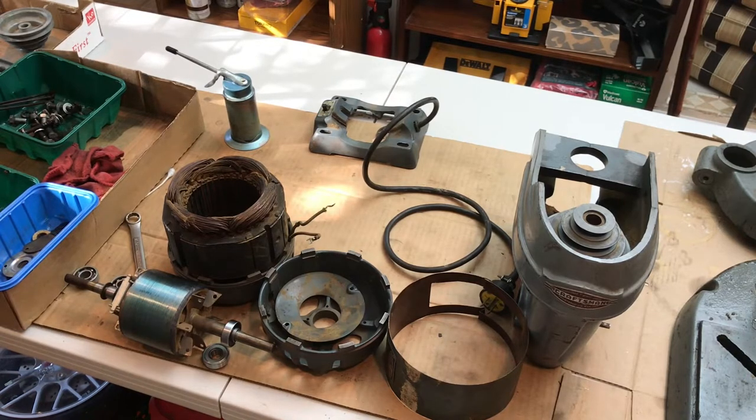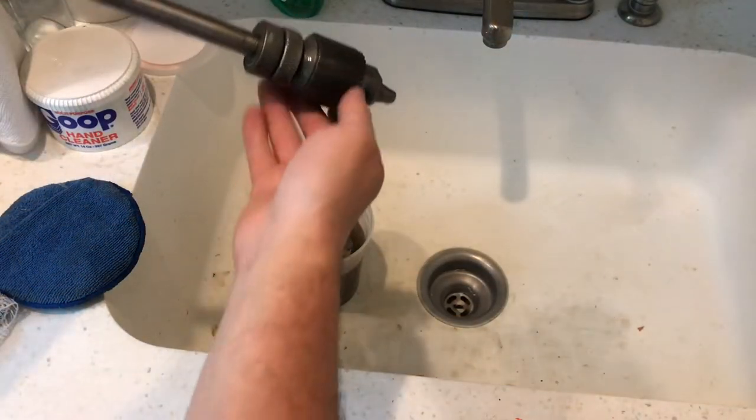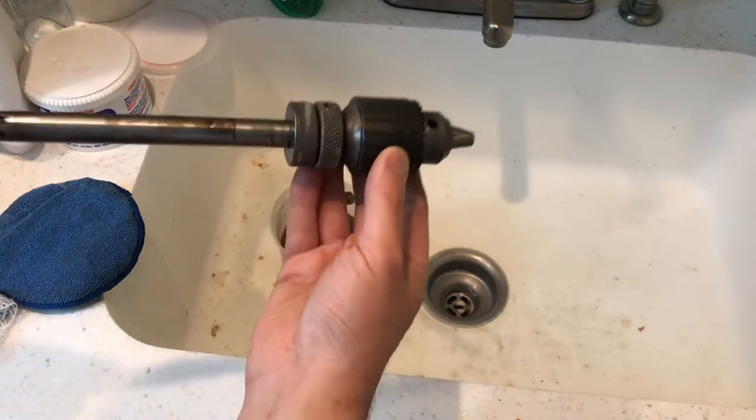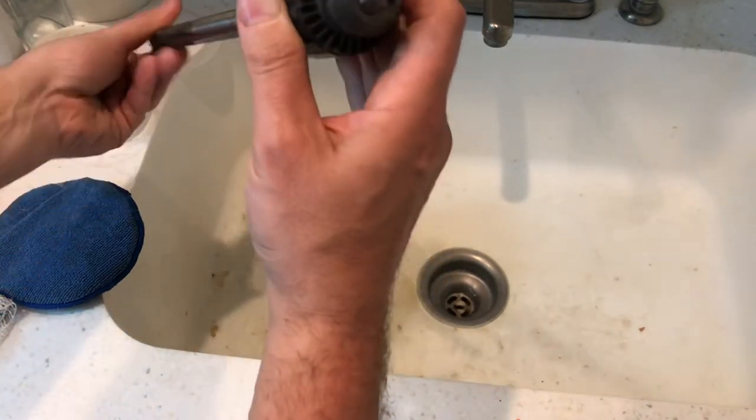I'm going to put a new grommet at least on the power supply. I really like the way the switch works from 1950 — a lot of older drill presses might have had a toggle switch added later but not something as nice as this. I do have the quill and spindle broken apart and soaking in the Evaporust. Everything's freed up and opening up nicely.